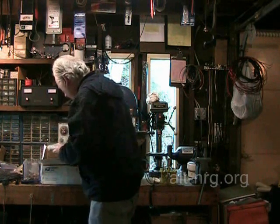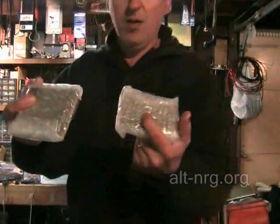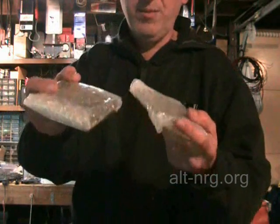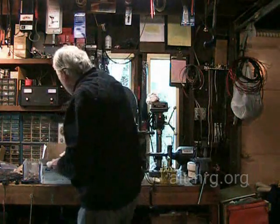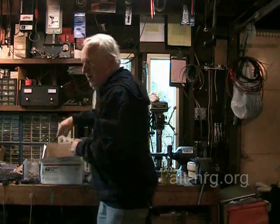These are nicely wrapped up from Larry — all of the plates that he media blasted for me. I'll be unwrapping these and handling them only with gloves. I'll be passivating them in a 10% solution of citric acid warmed up to about 110 degrees for maybe 10 minutes prior to assembly, and then rinsing with distilled water.